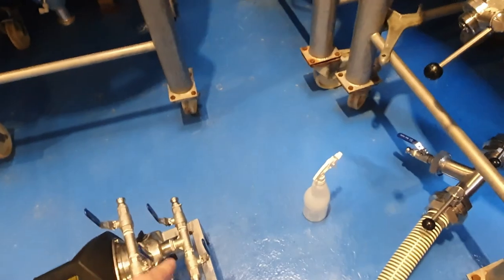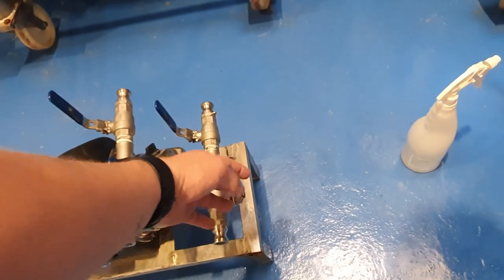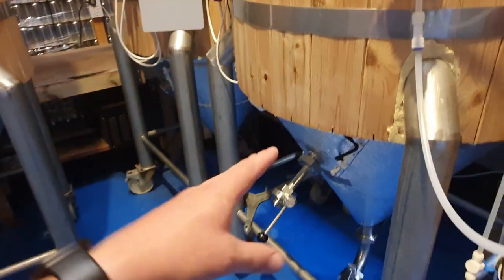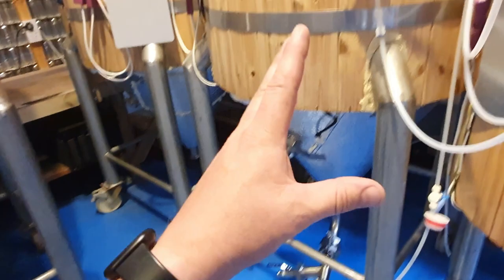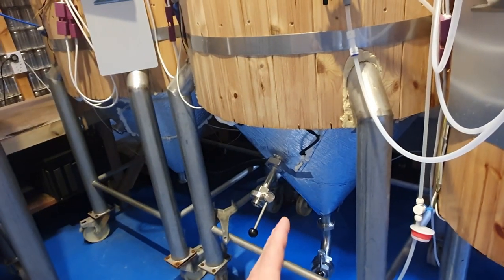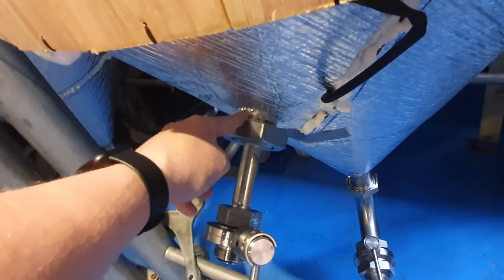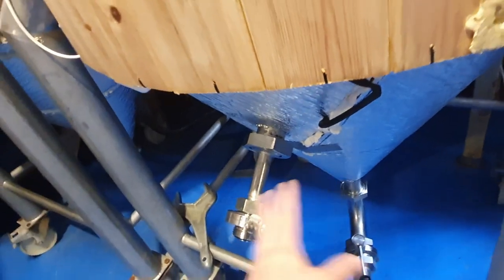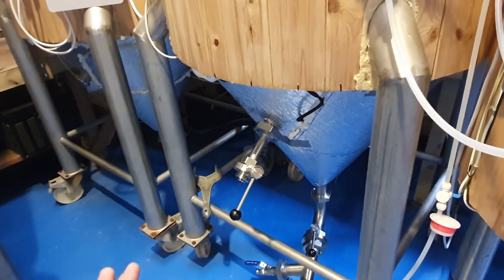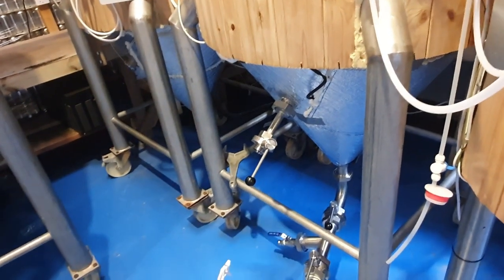Making sure that there's no caustic in these little hidden areas — making sure all the caustic is completely removed from the tank. Then we'll put acid in and do the same thing with the acid. The final thing is to disconnect everything, allow the acid to drain, close off the bottom valve, and we'll fill the beer in through the take-off port at the end of the brew day. And then up at the top, we'll remove the spray ball and we'll add a little CO2 pipe — not working under pressure, just gravity — so that CO2 can burp out without any problem.